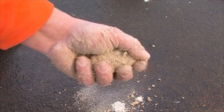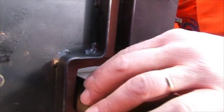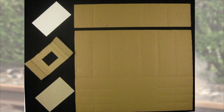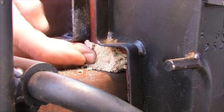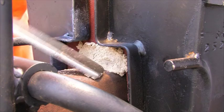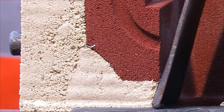During luting the mould at the rail head, cardboards are always used. These will burn later and create a split, which liquid steel will fill up. The dimensions and the utilization of the cardboards differ depending on the processes. In some processes, a spatula becomes necessary for luting the railhead. In this case, firstly push a little bit of sand through up to the spatula and compact it. Now fill up further sand and compact it. The pouring liquid steel shall meet a compact sand barrier inside, under the mould head.